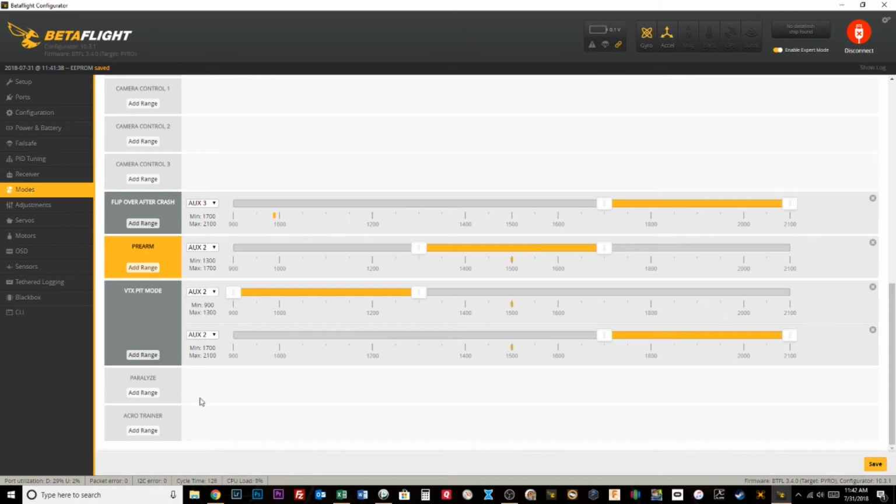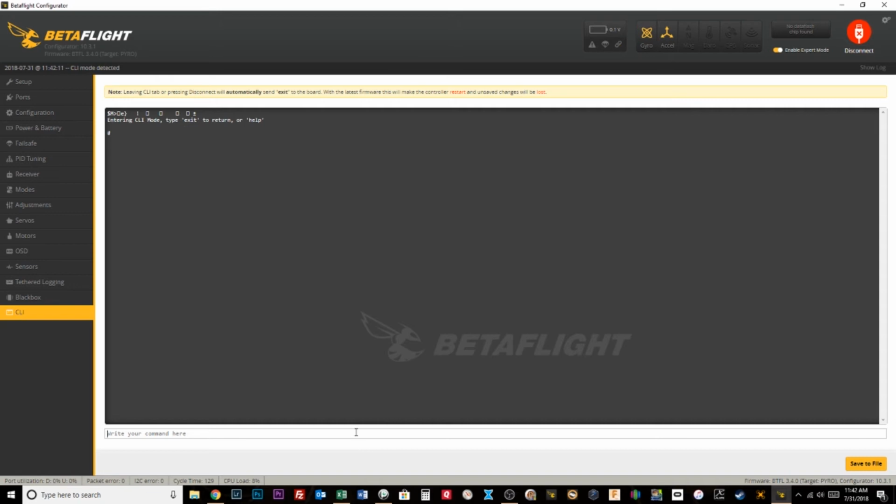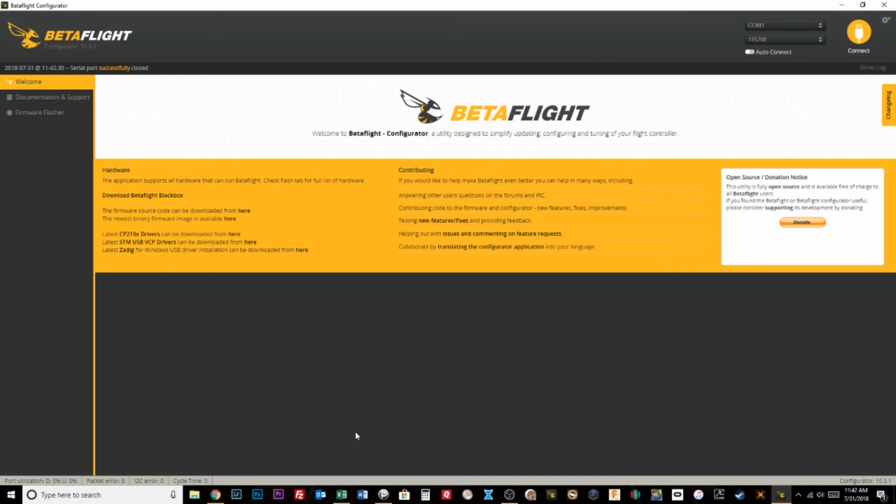That's the way that works. I'm gonna click save. We'll go into the VTX CLI commands again, get VTX, and this one likewise, I just wanna make sure it is on the same channel. It's on F2. Looking good. And we need to set VTX pit mode frequency to 5658. Hit save. All right, that quad number 2 should be now officially set up.